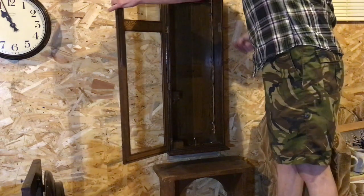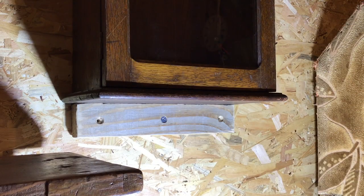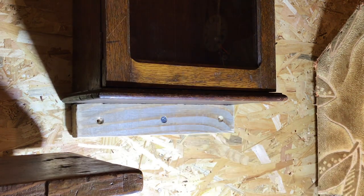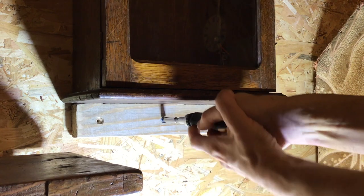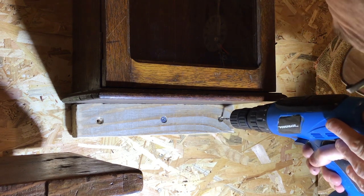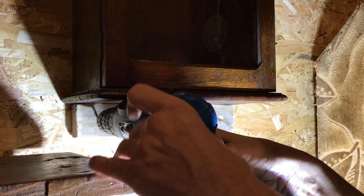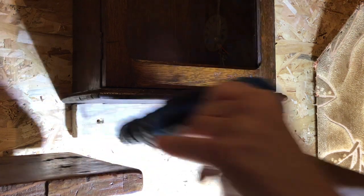So we'll now go and have a look at underneath the clock. Now, the chances are that no matter how careful you are taking the clock off the wall, this will tilt a bit. One thing you can do, of course, is to tighten up the centre screw fully. I'll just give that a go. But I'm going to be careful here. Take the drill, making sure it's at 90 degrees as I can, and just carefully drill these holes. This part of the wall's hollow, whereas the middle part, of course, had a beam. There we go, that's that.